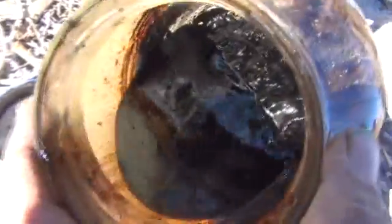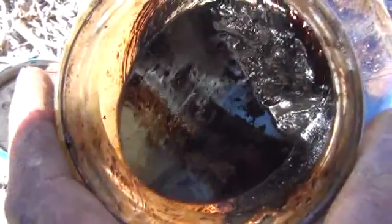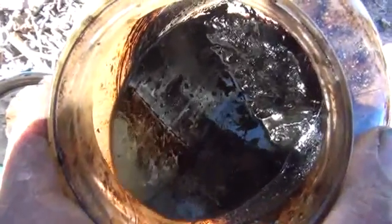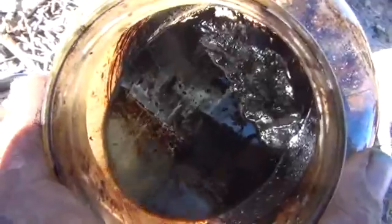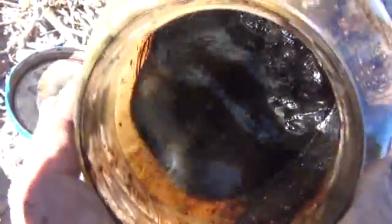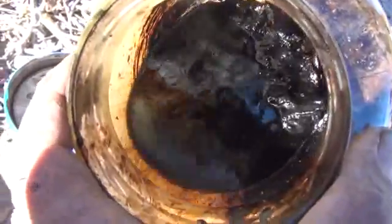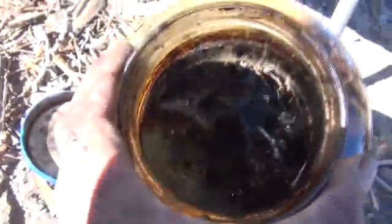The bottom stuff is more of a paraffin, extremely long chain carbons. So we have to throw those through and break those probably twice, which is the bottom part of our catalyst separation system. Now this liquidy portion that you see will probably give us most of our gasoline production today. We're not going to run a lot through, just enough to use up some of that catalyst metals I have in there. And I'm going to show you the gasoline that we produce at the end.